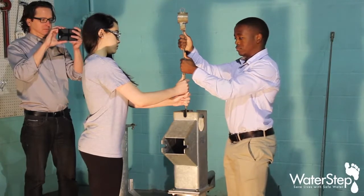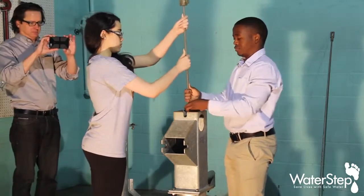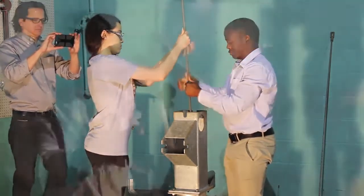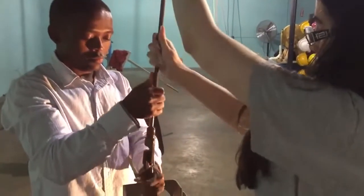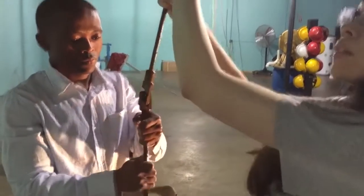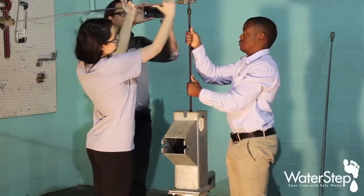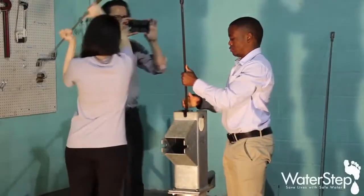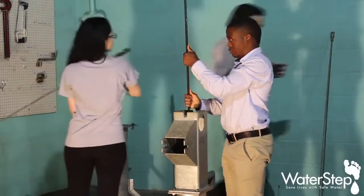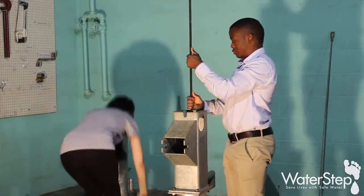Go ahead and do a hand over hand and raise this up and you will see the first juncture where the two sucker rods come together. This is kind of a unique attachment. What you do is you just hold and support the bottom sucker rod, bend it over, and then it just pulls down and slides out. Hand that to someone or lay it down because we will use these in just a little bit.